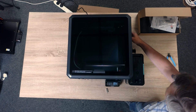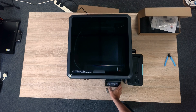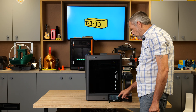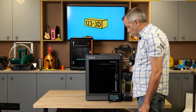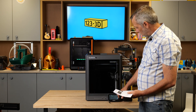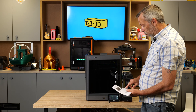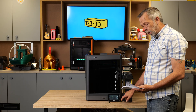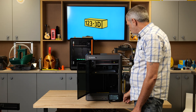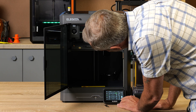We've got a file on here so I am going to load the filament - printing it straight out of a poly dryer, link to these will be in the description. Now, I don't know what jiggery pokery you have to do to load the filament. We have their extruder. Preheat the nozzle - we need radioactive temperatures - 280 degrees. Then press the extruder button and it should extrude some filament. My intuition was correct: go to the settings, input your temperature for the filament you are proposing to load - in my case 280 degrees - then click the down button repeatedly until filament starts extruding from your nozzle. I can feel the filament being pulled in. There's some really nice yellow filament coming out - that will be what was tested in the factory.